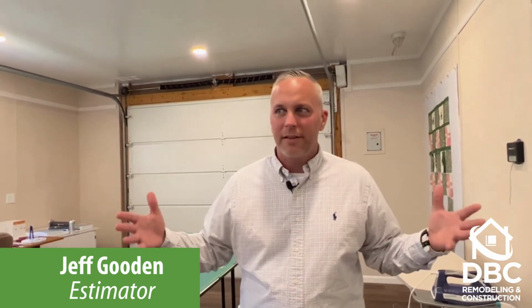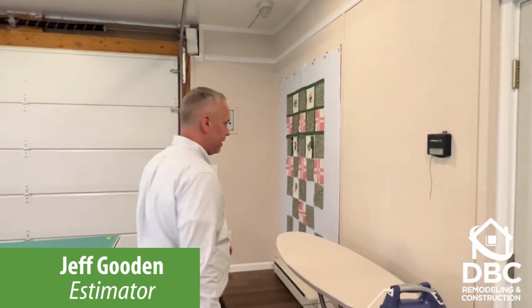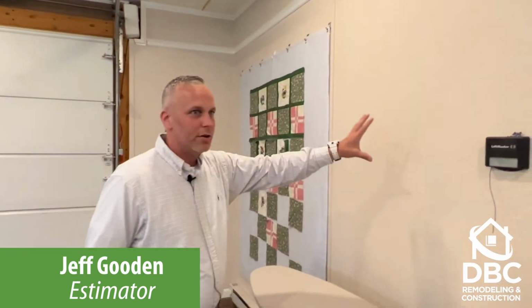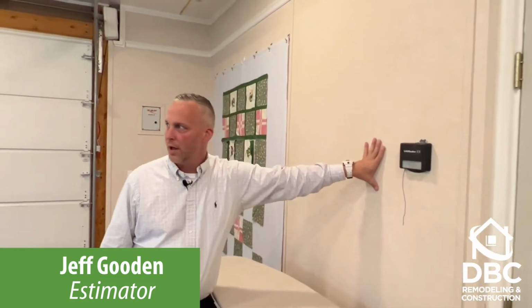So we thought, she has all these sewing machines. We figured let's build a room inside the garage to turn into her sewing room. So what we did, we brought in our EverLast insulated panels, our pre-finished panels, and we installed them all on her cement garage walls. So on the back of these walls, there's insulation that's about equal to R12.